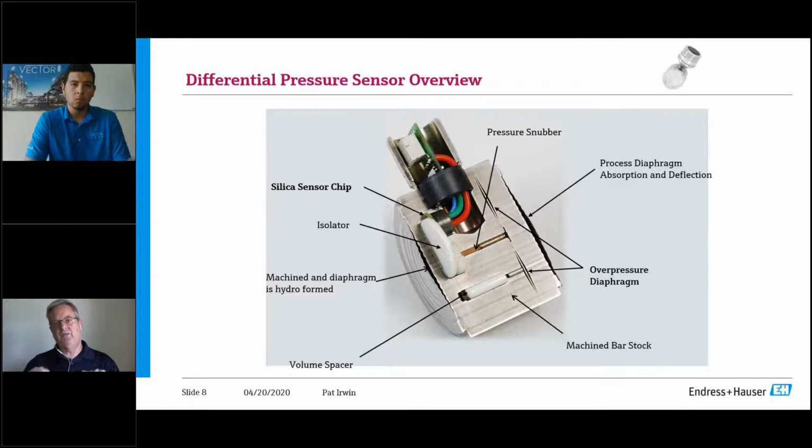So when you isolate with the two valves, you must isolate and close them totally. And then that way, if I've got a little bit of differential pressure on both lines, it's captured in those two lines. And let's go back to our steam reference, 300-pound steam. So I've captured at those lines. But remember, that little transmitter is only measuring about 100 inches of water.